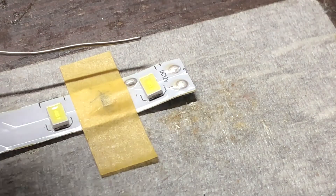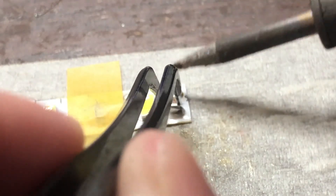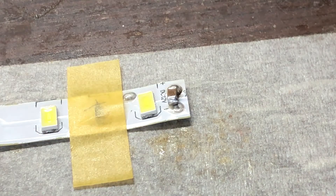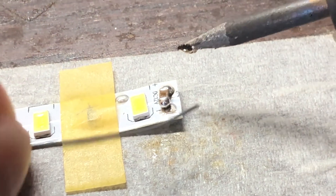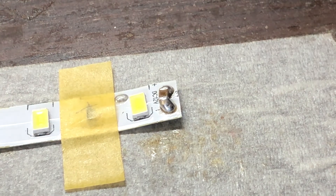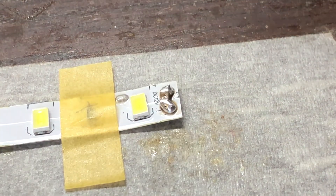The last component is the capacitor. Like the bridge rectifier, I solder one connecting side first, and then after that I solder in the capacitor. It doesn't seem to connect at first — a bit more solder and that's it. To ensure that the capacitor is flushed against the LED strip, I press it down with my Tamiya tweezer and then apply solder again. And we're done.